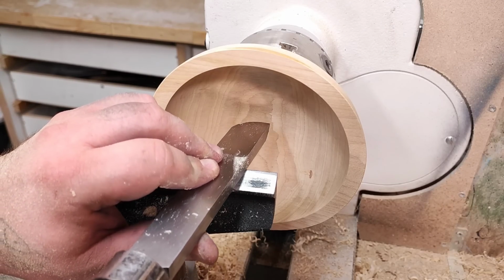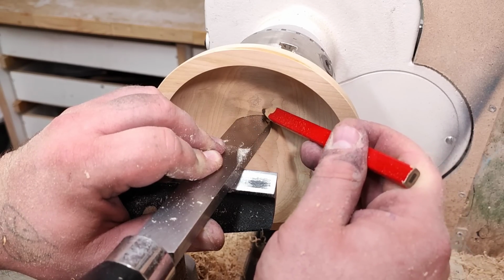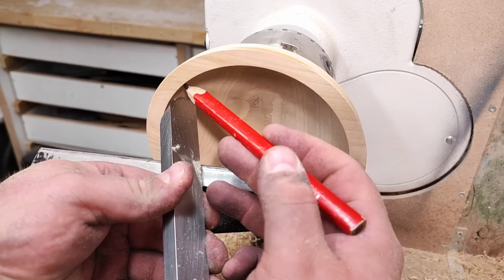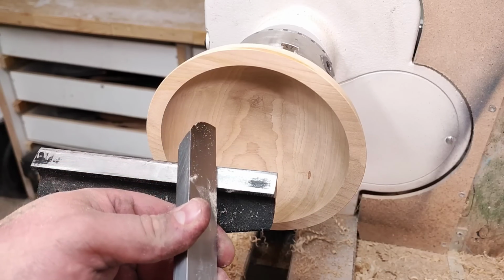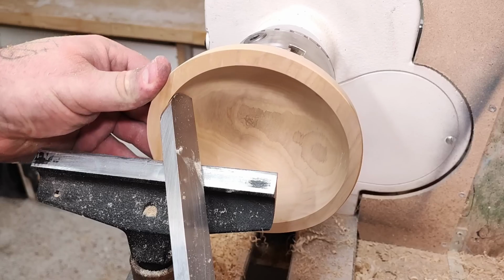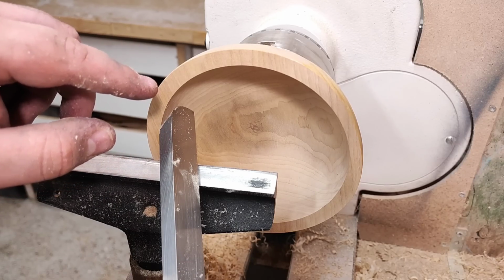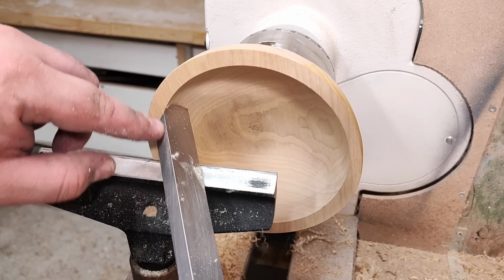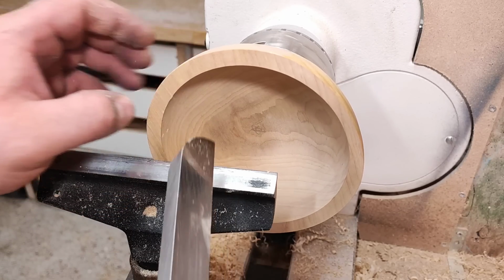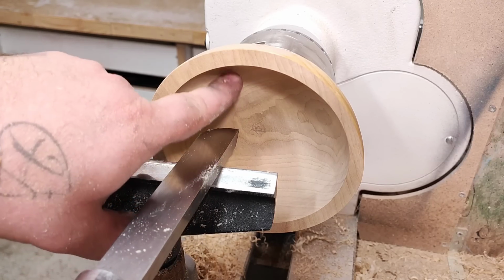So key thing to remember is always to have this angle of the surface you're scraping at this area here, and the top of your tool to be less than 90 degrees. So just to exaggerate this, if I place it here, let's say, hope you can see that this angle is way over 90 degrees. So if I would just stick this up in there, so drop the handle down, stick it here, I'll be okay here and here, but once I get to this end grain portion, it will dig in, and I hope you can see how it wants to draw it back on in, and that's the worst case scenario, because once these two points align, so top of your scraper and the grain here, it will just split it like an axe. So on a cross grain work like this, you never stick any blade like this up into the wood. So always have that negative 90 degrees.